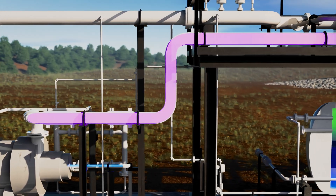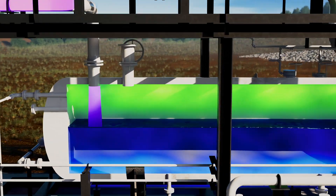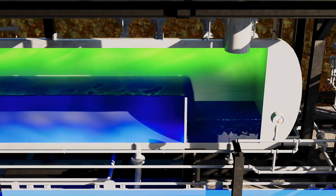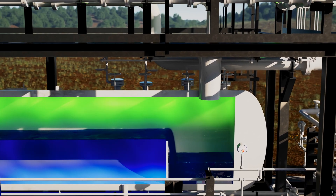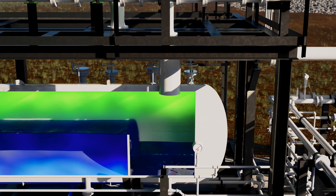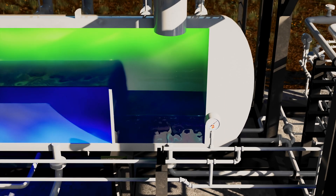From here, the compressed gas and water mixture is sent to a separator vessel. Water drops to the bottom of the separator and is sent back to the liquid ring compressor, while gases rise to the top, leave the separator, and are sent back to the plant for reuse. If necessary, these gases may be cooled depending on process conditions. Additionally, any hydrocarbons carried into the separator can spill over into another section for disposal.